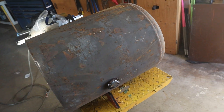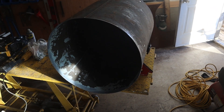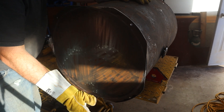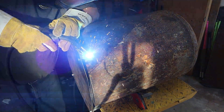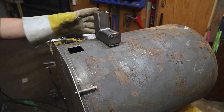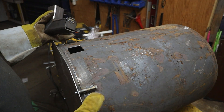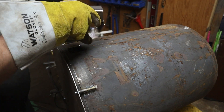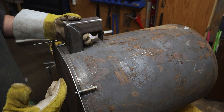This is the other half of the water tank. This is the section that's going to slide into the other drum that we were working on. I'm going to put that lid on and line it up. So we got the chamber done essentially — that's going to hold the wood that will turn into charcoal, kind of like a little pressure vessel. This is the bottom, and this is going to slide into the cook chamber, and then I'll weld this in.